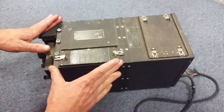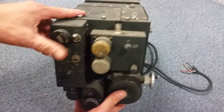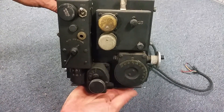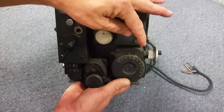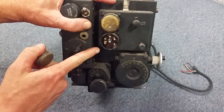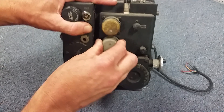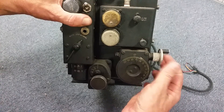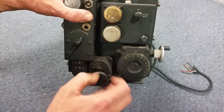Presumably the rear end was the same for both receivers, and the front end — the tuner section — is what changed. Let's take a look at the face. Kind of a busy face. We have antenna, alignment input, ground post. These are the standard power plug that the Navy liked in their aircraft sets from the 30s, and they used it into World War II. This one has a crank, but no doubt a spline could be hooked up to a control box. This is the band switch.